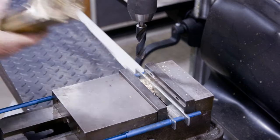So this is where the struggles begin. TIG brazing or welding brass does not work well in the horizontal or vertical position — at least I couldn't get it to. It's not like aluminum, which welds well in all positions. I thought brass might do the same thing but I struggled. You can see how it just gets super hot and just blows up on you — there's no in between. You have to hit that heat range perfectly to create a puddle. There was a lot of welding on this project and I would probably say I might have had four or five welds that I hit just right and was actually able to get a bead on there.